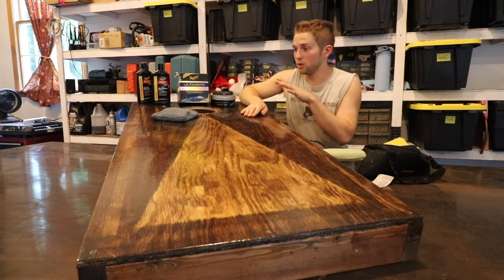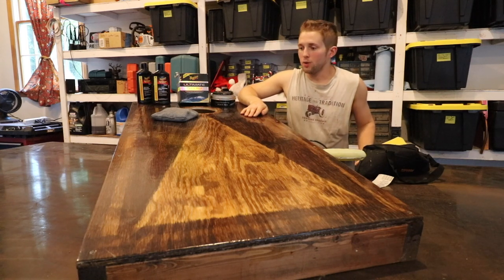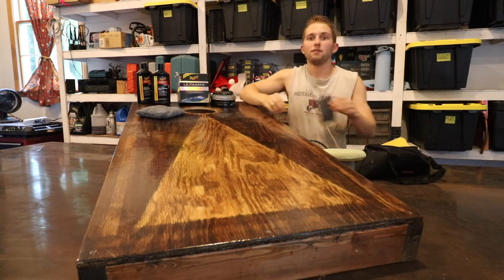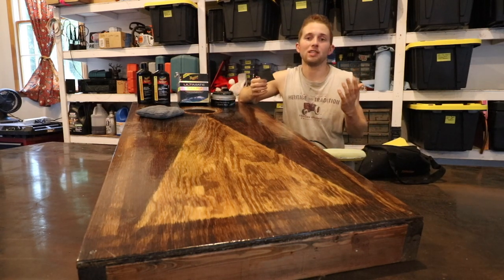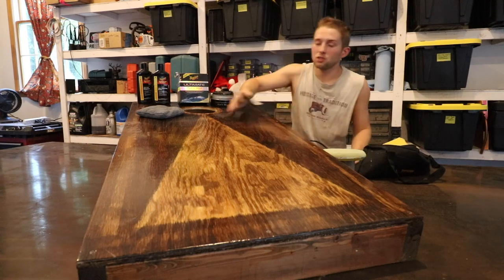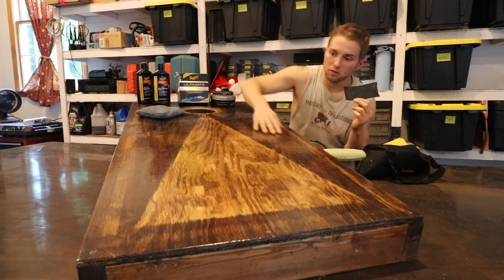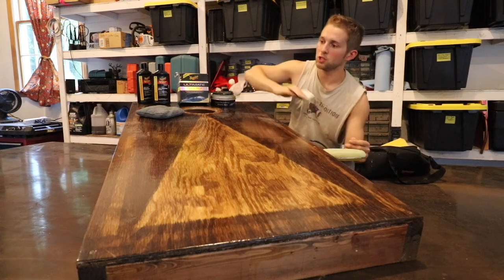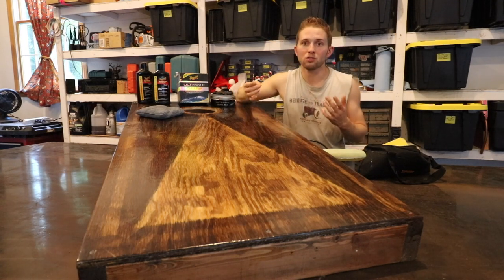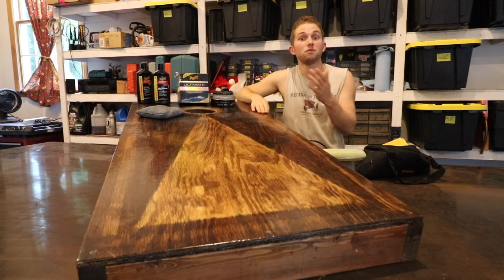So again, in order to do this finishing process, you need at least five coats of polyurethane. For making boards extremely smooth, the first step is wet sandpaper. I started out with 1500 grit wet sandpaper — this is going to take a lot of elbow grease. It all depends on your preference of how slick you want your board. You get your boards wet, take your 1500 grit, do small circles, and go over the whole board. Then I moved on to 2000 grit wet sandpaper, which is a little more fine and removes the fine scratches left by the 1500 grit.